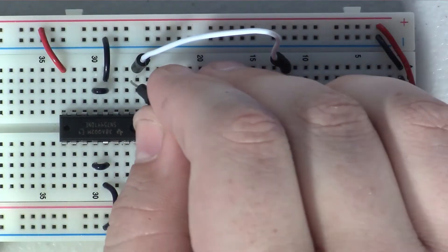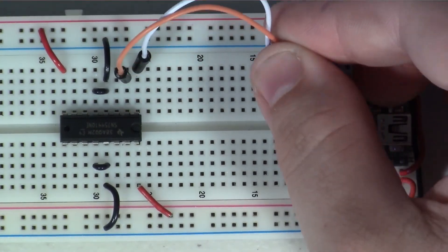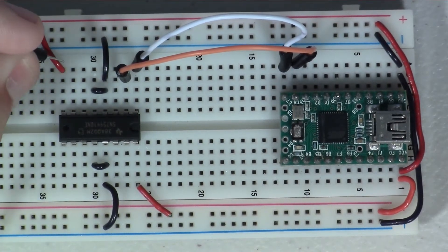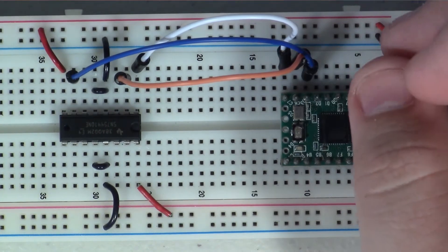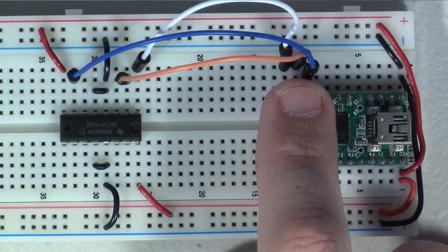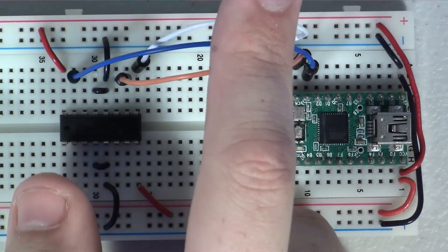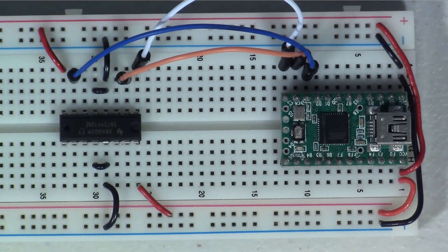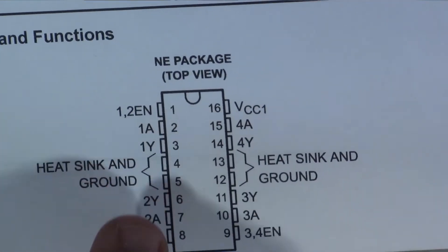The orange wire I'll plug in right next to the white wire and connect it to Arduino pin 9. Then on the other side, right next to the motor VCC, I'll plug in the blue wire into pin 8 on the Arduino. So we're using pins 8, 9, and 10 on the Arduino — both directional control pins connected to the chip as well as the enable pin, which translates to our speed control.